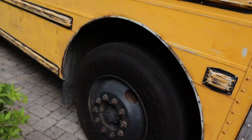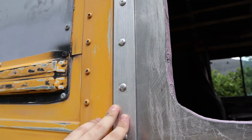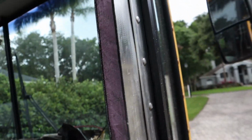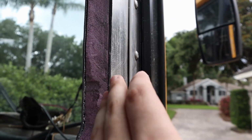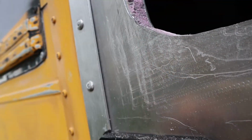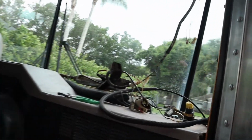But for those who want to know how I built the door, what I did is I got aluminum U-channel, and if you can see, I got two sheets of aluminum that just went right in between the U-channel, sandwiching a piece of foam insulation, and then rivets down the side that are just into the aluminum sheet. I glued the foam and aluminum sheet together, so that's glued as well. But yeah, did that all the way around, 45 degree corners. I built it kind of in the frame in the sense that the frame wasn't square, but yeah.